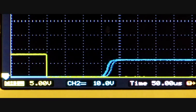So 150 microsecond delay processing, and that includes the opto-isolators in and out of the circuit, and this really doesn't take into account the switching of the power MOSFET, but that's going to be negligible. So the biggest delay is the processing. That's it for this.